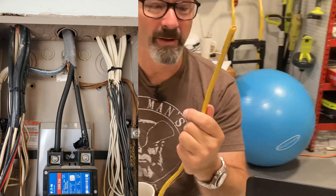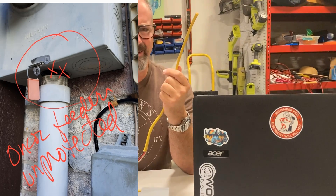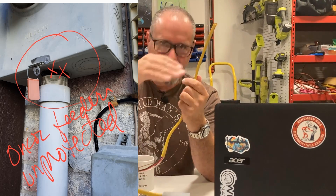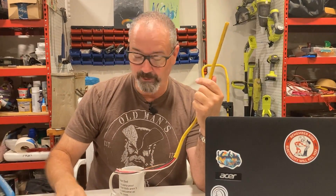I'm not just being picky like, 'well it doesn't matter, it's landed right.' Nonsense — that's just wrong. Metal will cut this. This is PVC sheathing and it'll cut. You've got to protect and secure — protect and secure. Think of these as the policemen of panels and boxes.